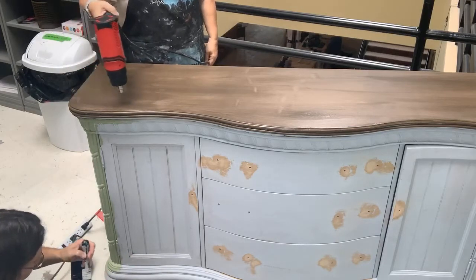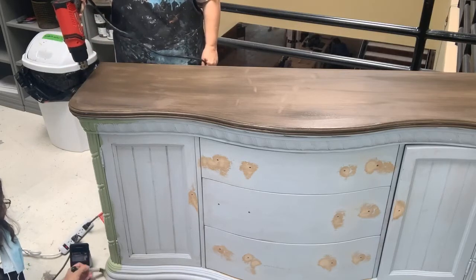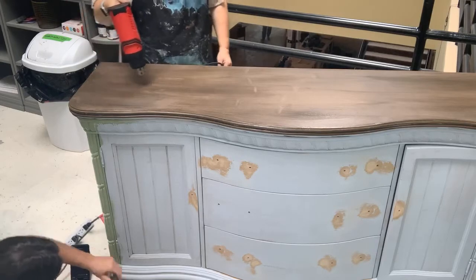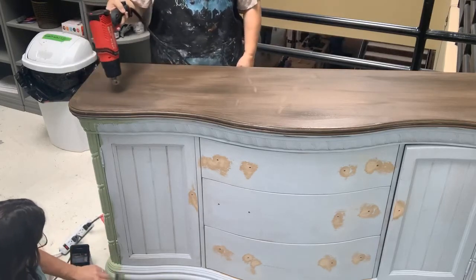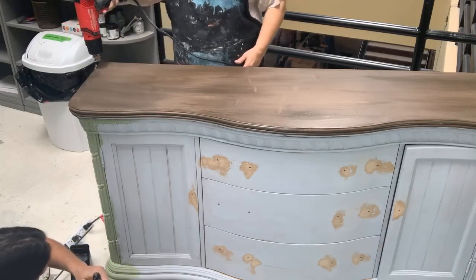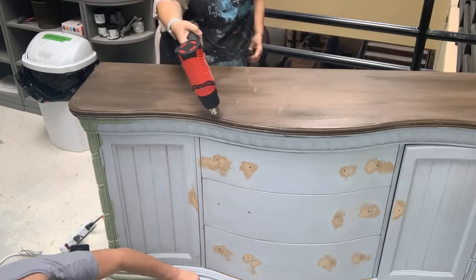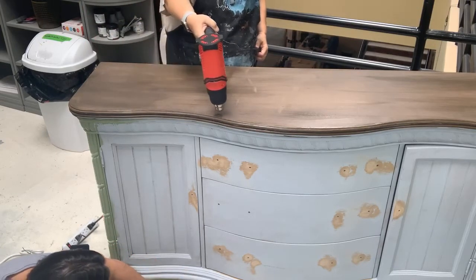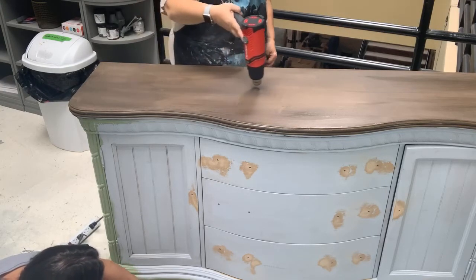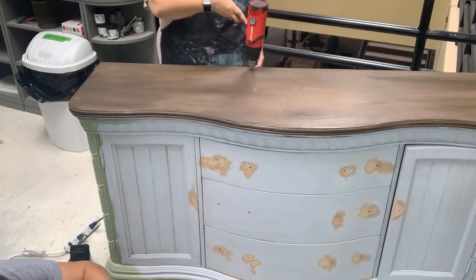And now I'm just drying this. I'm actually going to do two coats of the brown, give it a nice solid coat of brown. That was important in this finish because when I distress, I'm going to dry brush over the top of this, and I'll be distressing back to the brown quite a bit, and even possibly as far down as the wood underneath in some spots. But I need this brown to be a nice, deep, rich brown so that it has a little more of a feel of wood, even though this doesn't ever look anything like wood when it's done.